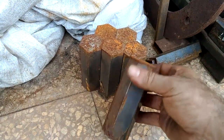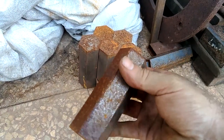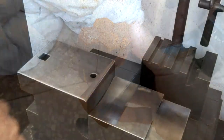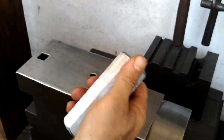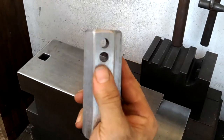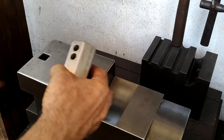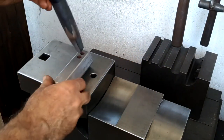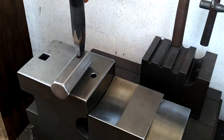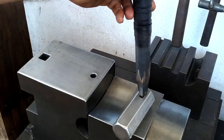This hex stock was for hammers, so I'd like to make those hammers and get rid of them. I've cleaned this piece up and drilled two holes for where the eye is going to be. I don't always do this, but today testing that short blunt punch, I think this will help me see if it's going to work or not.